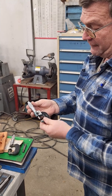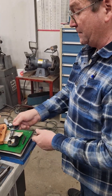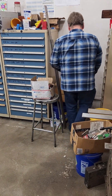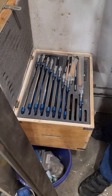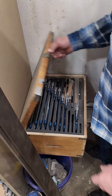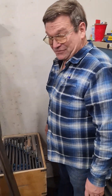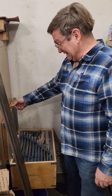I'm kind of surprised this one doesn't have a vernier on it. I've got several of these and most of them have the ten-thousandths verniers around the side — that surprises me that this one doesn't. Your micrometers come in different lengths, normally in one-inch increments. You'll get sets like this one, which is a 0 to 12. This is an inexpensive one, I've got some more expensive ones up there. I haven't seen accuracy problems. Some people complain about how you can do machine work with Chinese stuff, but there's stuff made all over the world that works and some that doesn't.